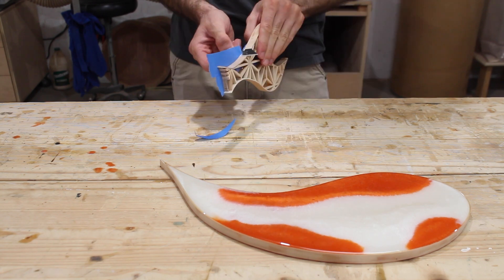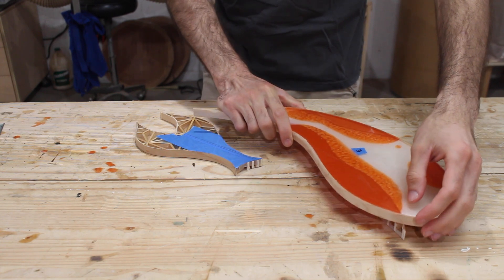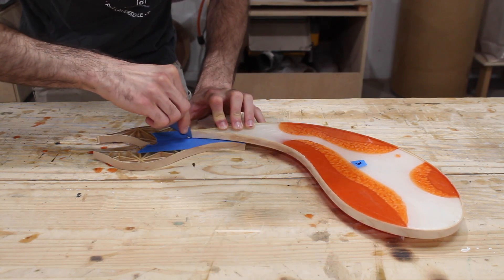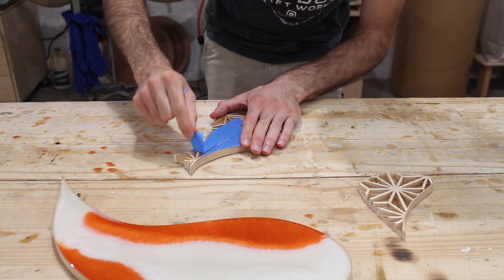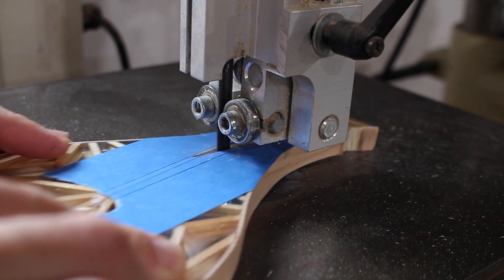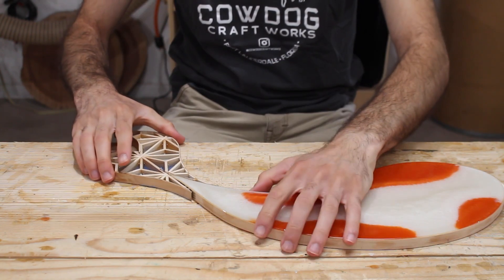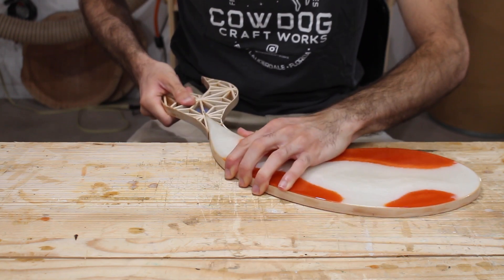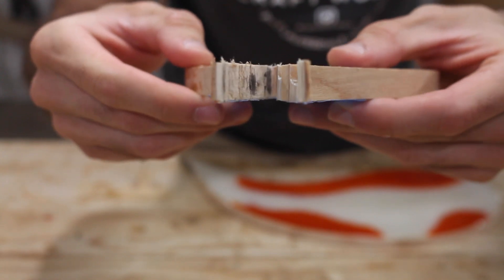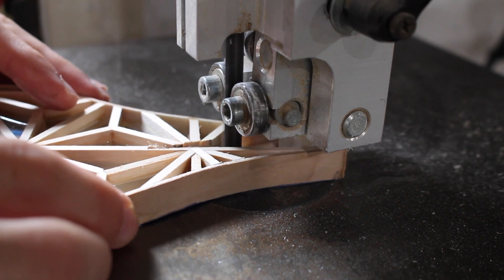Throughout the project I wasn't really sure how I was going to fit the fins to the body, but this is what I came up with. I covered the back of the fins with blue tape and positioned the body on it how I wanted it to fit. Then I traced the body with a razor blade and cut out the tape so I know what section to remove. I'm cutting right on the tape line with the bandsaw — it won't give a perfect fit every time, though I got lucky with one of them. For the rest, I marked the area where the tail meets the body with pencil, which acts like carbon paper — wiggling the tail back and forth rubs the pencil off onto the high spots, marking what areas to remove. This is a tight spot so instead of sandpaper I'm running them backwards on the bandsaw blade, which lets you fine tune really well.